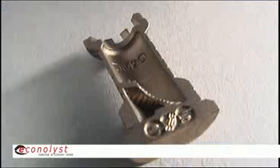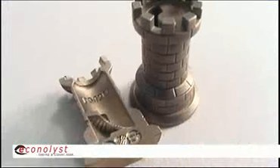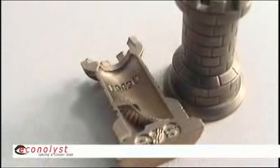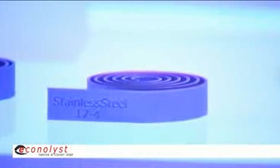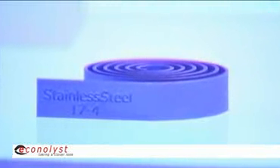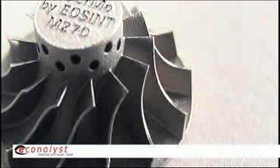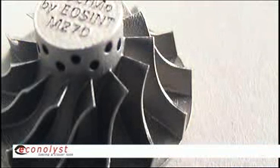Things are continually changing. With polymers, you're restricted to nylon 12 as the base material, which can be quite constricting because you don't get a very high standard of properties from that. On the other hand, with metals it's a very different picture. At the bottom end you start with a bronze-type material, which is a multi-phase melting material with fairly straightforward characteristics. You then move on to a range of different steels: a basic tool steel, maraging steel, and 17-4 stainless steel — those are the main steels available to us.